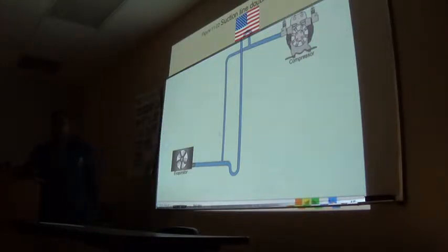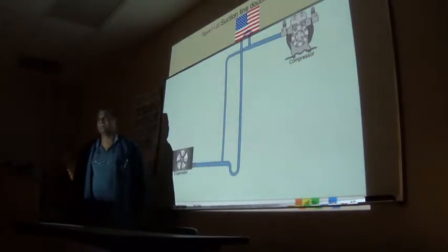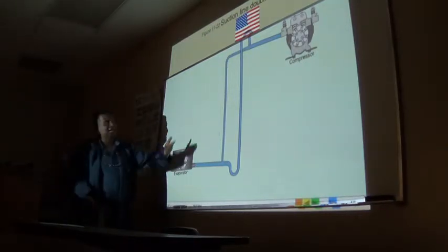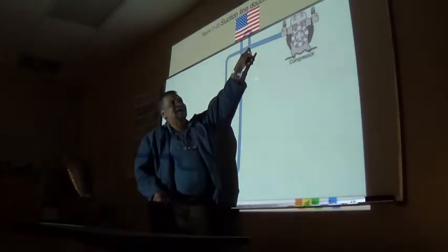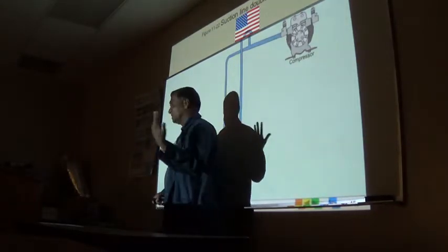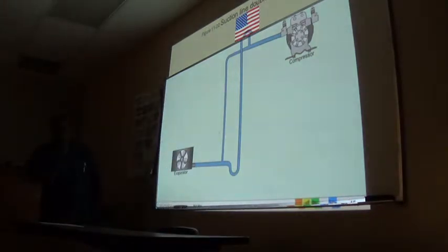Repeat that again? Once you make smaller lines, you increase velocity. Once you have increased velocity, the oil will have no problem getting sucked up, going back into the compressor. And it doesn't really matter here that it goes into a bigger line because it's already pretty close to what the compressor takes. And it is sloping slightly downward.